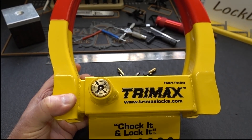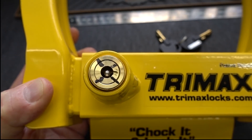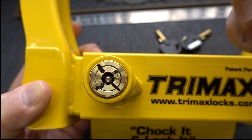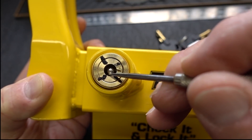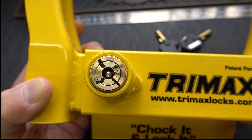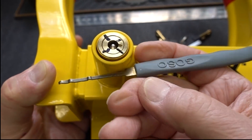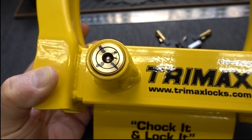On the lock itself, I've already marked it — it might be difficult to see, but there are actually four banks of pins. I kind of expected to find three. They're at 90 degrees opposing each other. I marked them with a magic marker so you can see what I'm going to try to do. The other nice thing is they have a very thick center post, which really restricts what we're going to be able to get in there. I tried the thinnest goso rake I have, and that post prevents raking those four banks of pins. So that's a good thing.